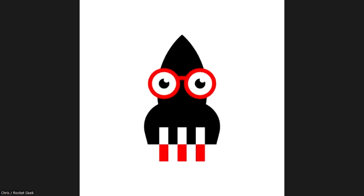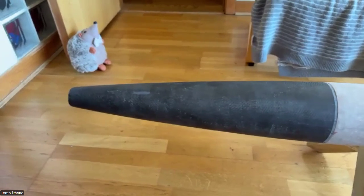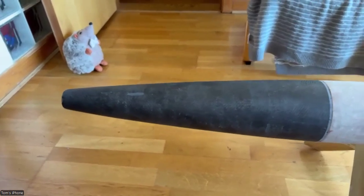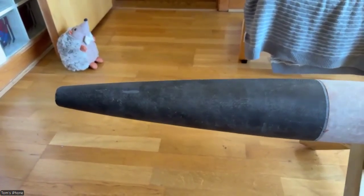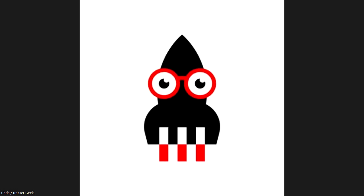Are you guys expecting to go real fast? We're looking at Mach 1.7. Yeah, but this is our first time going supersonic, so we're being slightly overcautious on the heating aspect of it. The Onyx should have actually survived, but the carbon fiber improves the rigidity, and then the tip is obviously a heat sink as well as our attachment for recovery. I think we were quite cautious on that aspect. It should be fun.